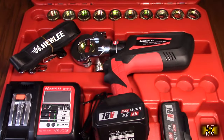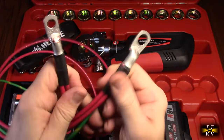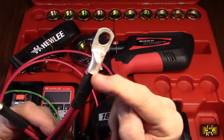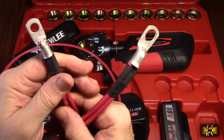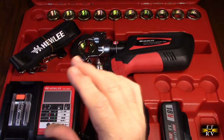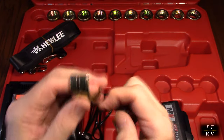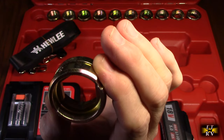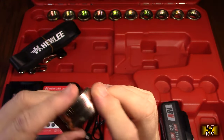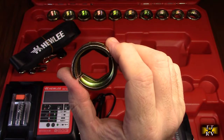We're going to demonstrate this using two of the larger dies. I've got wire set up — a four gauge and a one gauge — with multiple heavy-duty wires already stripped and lined up ready for crimping. The crimps have a little beveled edge to accommodate the conductors inside. Just to show you how large the dies get: here is the largest die included, number 12. Look at the size of that — it's 300 millimeter and 600 MCM, which is incredibly large. If you have an industrial application where you've got to put thousands of amps through something, that's the one you'd use.